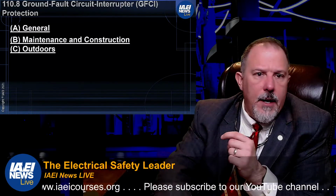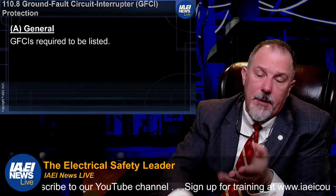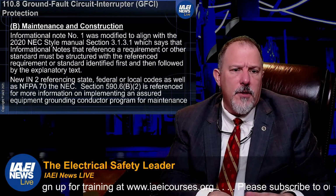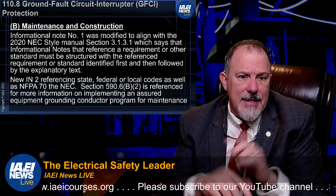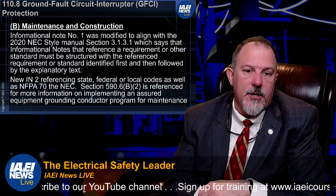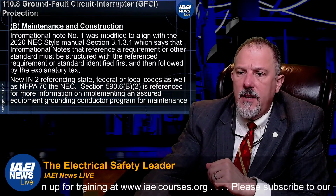All right, so A, general maintenance and consideration. GFCIs are to be listed. That's new. I believe it's going in the 2023 cycle. It may already be in the 2020 code, if I'm not mistaken. All of those are going to be listed, and informational notes were modified to align with the style manual. Like I said, there is a new informational note referencing federal and local codes, as well as NFPA 70, the National Electrical Code. And it's all about implementing an assured equipment grounding conductor program.